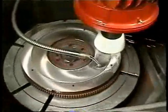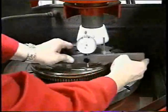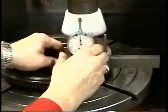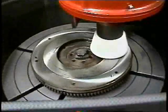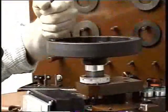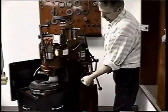The difference is to be ground off of the outside pressure plate surface. The result should be the same measurement you recorded originally. A stepped flywheel is mounted and ground in the same manner as a cupped flywheel. The difference is that the outside pressure plate surface is lower than the inside friction surface. These flywheels must also be measured first. The friction surface is ground, then measured, then the pressure plate mounting surface is ground to repeat the original measurement. The FG4000 adjusts differently than the FG5000 and FG10000. You must first release the locking handle to move the grinding head in and out for positioning. Be sure to lock it securely when you are in position.